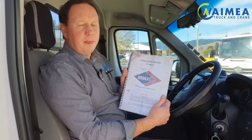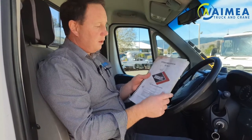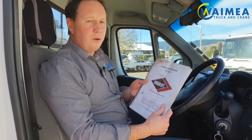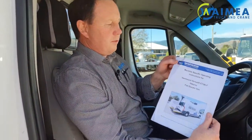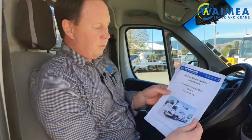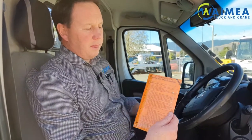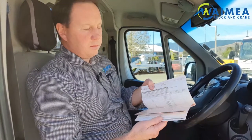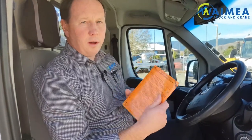Number 1: the operator's manual contains all the information you need about the safe and efficient operation of this boom. I highly recommend that it stays in an accessible place in the vehicle and that you refer to it for your daily checks and safe operation. We've also included machine-specific operating instructions for this boom, pulling the critical information out of the manual on how the controls work. Every EWP should have one of these — that's what you fill out with your daily safety check records, any faults, problems, and routine maintenance. That stays with the vehicle, filled out by the operator on a daily basis.